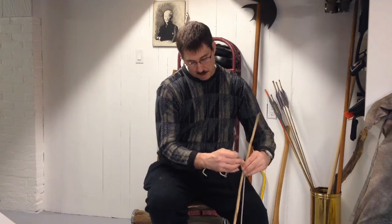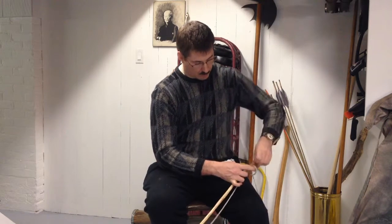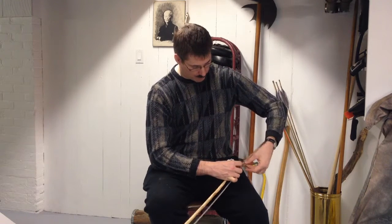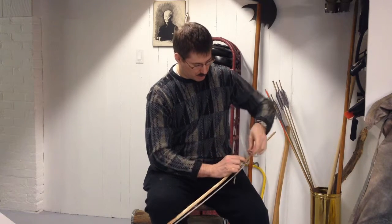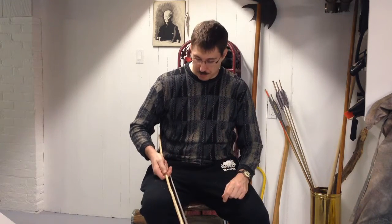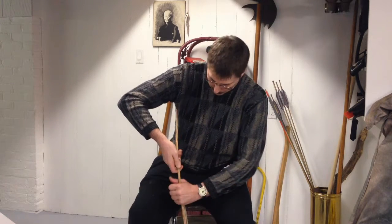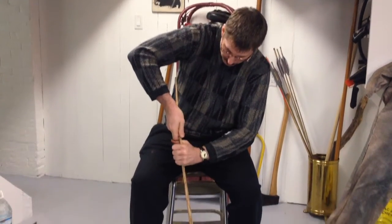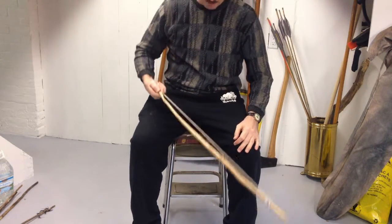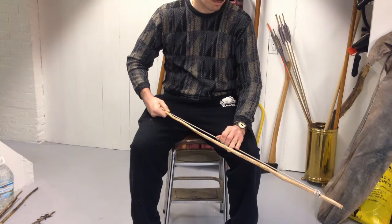I'll tie the second rolling hitch, working my way up against the direction that the pull is going to be in, and finish it off. If there's some extra length, it doesn't hurt to do an extra turn or two. You don't have to be too fiddly about this because this spare rope is going to be in your hand when you're drilling anyway. Here's the beauty of the rolling hitch: I tied this with a loose string, but if I want it more taut, I just lean on the stick, put a little bend in it, and pull the rolling hitch up until it has the amount of tension I want, and it will tend to stay pretty much exactly where I put it. And essentially now we're ready to go with our bowing.